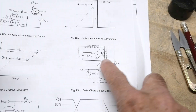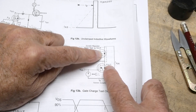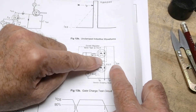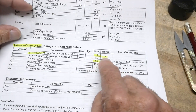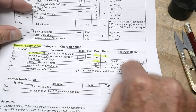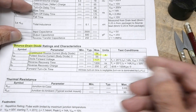Inside these parts is a back-biased diode. If anything tries to go this direction it'll go through it, and it'll block anything going the other direction — sort of a protection diode to save the FET from pulses and stuff. There's a specification on that diode. It's the source-drain diode, also good for 14 amps, and at 14 amps its forward voltage is 1.7 volts — which is okay for a protection diode, but it will warm up.